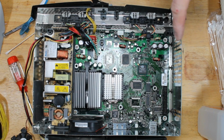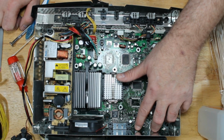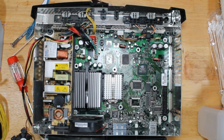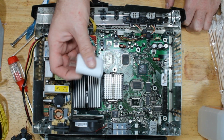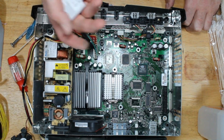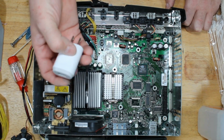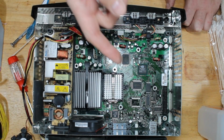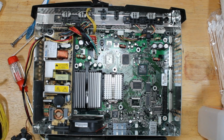So that'll work perfect if I decide to install a LED strip in this, because it steps down into the little box that it has, because you can plug them in with just a straight phone charger adapter like one of these. And they will step down in the little controller box down to whatever voltage it needs. And some of these go up to 2.5 amps. And it's the amperage that's going to do more damage than the voltage. So 12 volts, it should step it down just fine, and I should be able to use LEDs in this with no problem.